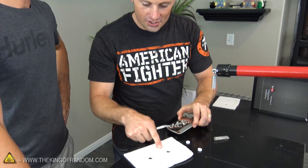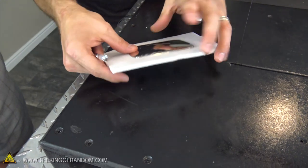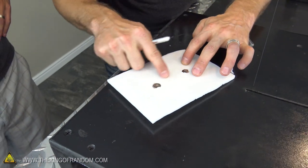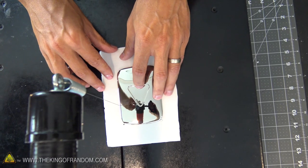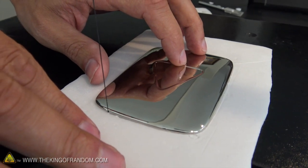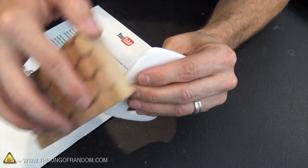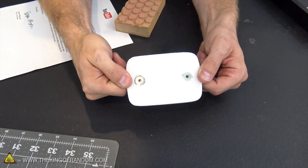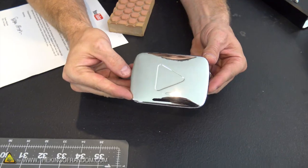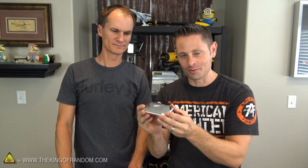Okay, so here's the idea guys. John's just cut a couple holes in this foam that should accommodate these little rivets there. What's really impressive is you can see it almost lines up perfectly flush. We press this flat, turn on the foam cutter, and we're going to cut a clean line all the way around this button. All we have to do now is take a sanding sponge and kind of clean up some of these edges to get rid of that jagged styrofoam, and the rest should be pretty easy. We're basically just going to take the frame for our vacuum former, staple some plastic to it, stick it in the oven, and then stick it on our vacuum forming machine. So now we got the styrofoam reinforced. I think this is ready to vacuum form.